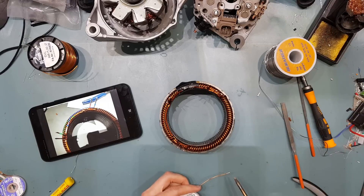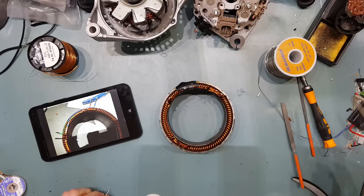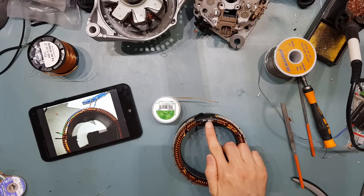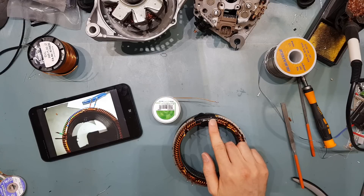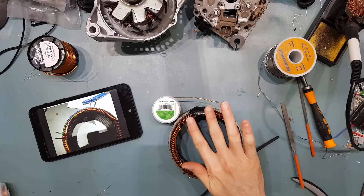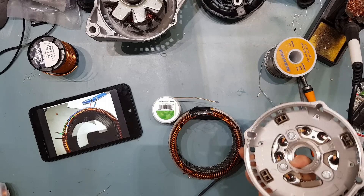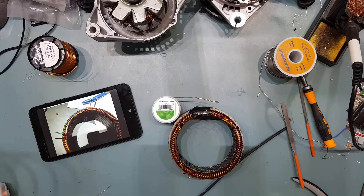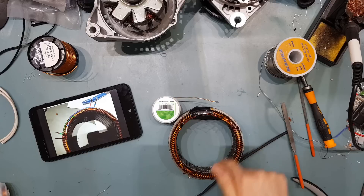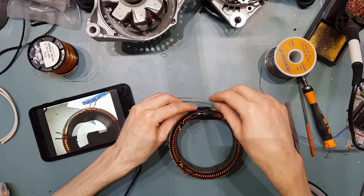It looks alright. Now you're going to want to insulate this. I've seen some people use what I believe was glue-lined heat shrink, which is probably what I'm going to do in this case. I've also seen people use sleeving. The issue is that the thicker the insulation you use, the bulkier it becomes and the harder it can be to get the housing back together. So it's something you need to be aware of — if this is too thick or protrudes over this way, it won't fit together properly. So I'm just going to use standard heat shrink this time, because it's what I'm holding.